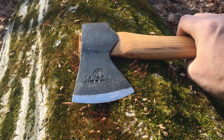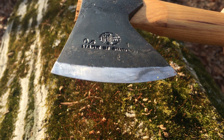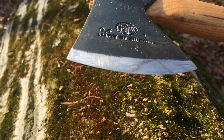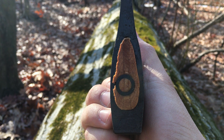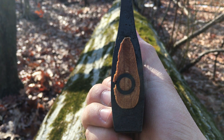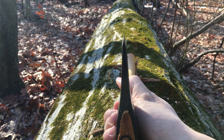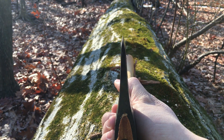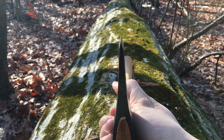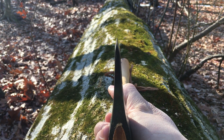Speaking of the head, it measures 5 and 3/8 inches in length, and the blade is just a shade more than 3 inches. At approximately 1 pound in weight, it is a Hudson Bay pattern head with ears that provide a firm grip on the handle. The major disappointment was in the way the head was mated to the handle — whoever pounded in the circular metal wedge was off, causing a piece of wood to flake off. I consider this a huge lapse in quality control, especially for such an expensive tool. The head does feature a perfectly symmetrical and very acute cutting edge that smoothly transitions into the cheeks, a design to enable deep cutting capability without compromising splitting capability.